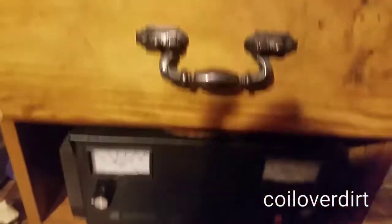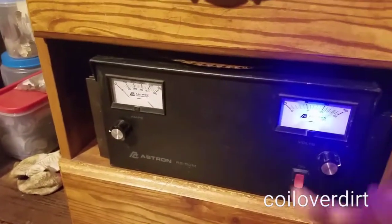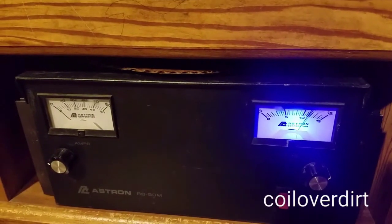I'm going to turn this on and pan down here. I'll flip the switch on my power supply - I've got it on about 12 volts with the amperage about a quarter of the way up. Hopefully you can see the bubbles coming off the lead, and you can see them starting to come up off the horseshoe itself. What that's doing is breaking up that rust. The positive is on the anode, and the negative is on the item you're cleaning - that draws the rust away from the item over to the anode, so the anode collects the rust.